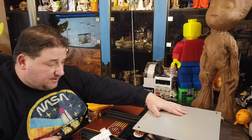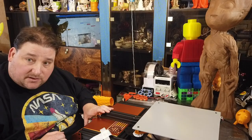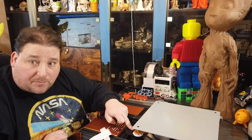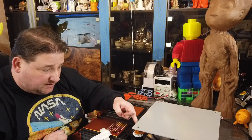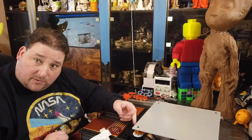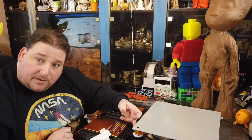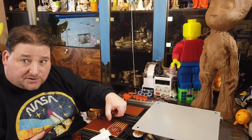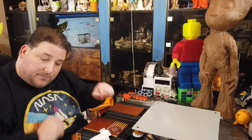Okay. The motor itself, these are adjustable on the end, but I think it's better just to leave these alone. And you have slotted holes that the stepper motor attaches to here on this bracket. So loosen all four bolts. This motor will then move forwards and backwards this way. Okay. Push it back with your hand, tighten the bolts up. There you go. You just tensioned your belt. You get that little bit of a twang, but not too much. Too tight is a problem. So we will now go on to installing the gantry.